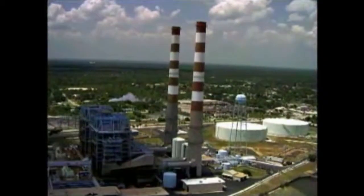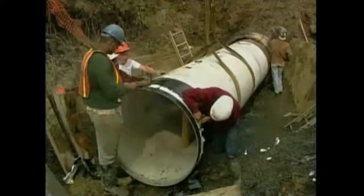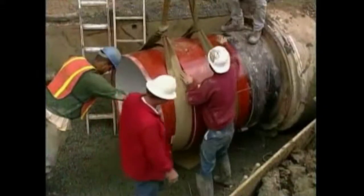In the real world, LinkSeal improves overall system reliability. By effectively dampening the damaging effects of vibration, LinkSeals reduce fatigue on pipe welds, flanges and threaded connections. As an added bonus, they may also be used to isolate stray electric currents passing through pipes and casings.